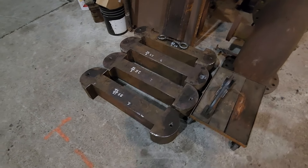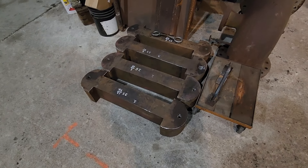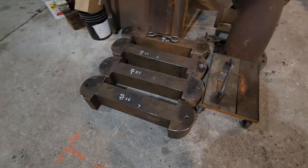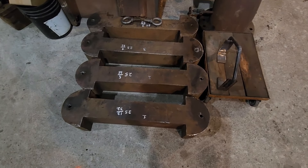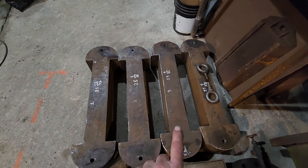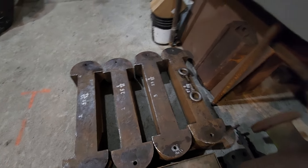These are what are colloquially called dog bones, and there's two on each side of the flywheel where the rims come together. The way that Todd did things, as you can see these dimensions — 25, 13/32, 5/16 — they all correspond with a measurement taken of the opening on the flywheels.